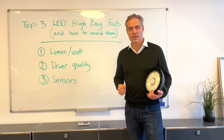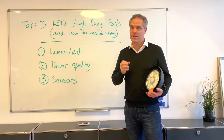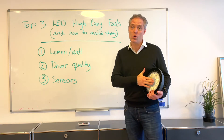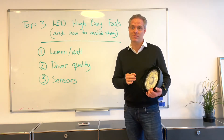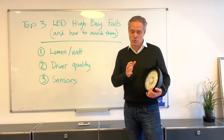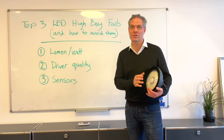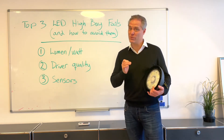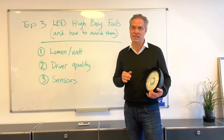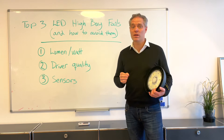The other option is if you've got skylights with natural light coming in from above, you can use daylight sensors. Basically, whenever the sun is shining, the sensors will sense this and dim down the fitting so that you always maintain high lux levels using natural light rather than the fittings. Some sites have up to 30% of their roof covered by skylights, and that is massive savings in the summertime when you've got 14 or 15 hours of daylight.